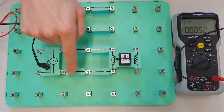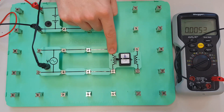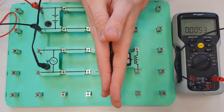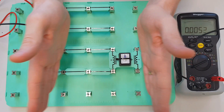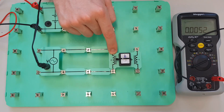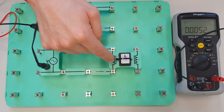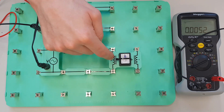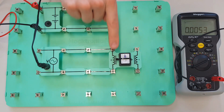However, if we take this coil and we connect it to the AC supply, what we've now got is a situation where the current is flowing backwards and forwards through the coil. What difference does that make? Well, think about what's happening with the magnetic field around this coil — it's expanding and collapsing all the time. And as it expands and collapses it cuts back across the coil that created it in the first place, and as it does so it generates electricity back inside there. But the current that's generated back inside the coil is trying to push in the opposite direction to the current that is creating it in the first place.